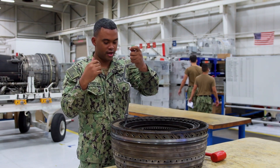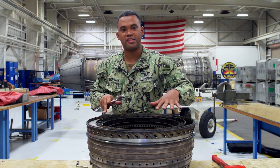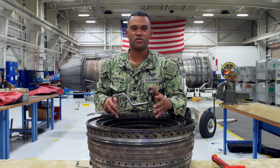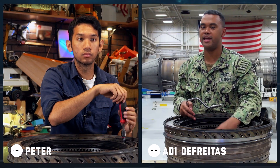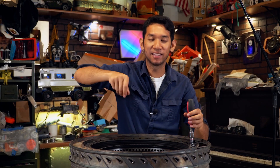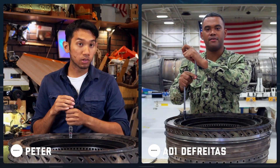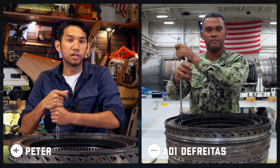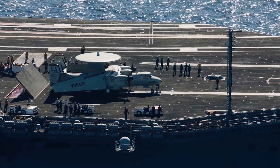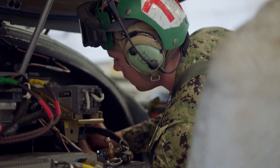So I installed all the bolts already. Now I'm starting to tighten them down with a speed handle. Some things to look out for: make sure that the INS is actually seated and the holes are not off, because if they're off the bolts will be hard to go in and it will cause stripping of the bolts. You destroy the bolts, you destroy the INS and it's the whole process of redoing the whole thing over again. I try to hand-start them before I run them in with the driver. I feel pretty good — I'm pretty much just snugging them back down. My takeaway is if you're mechanically inclined, you can work on very expensive, very big aircraft in the Navy. And it's great if you're mechanically inclined, but you don't need to be — with on-the-job training, you can be the best you can be.